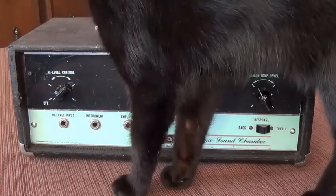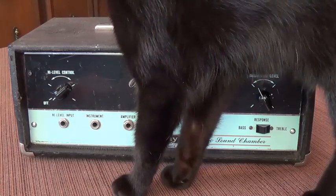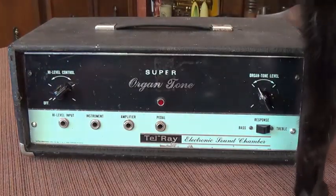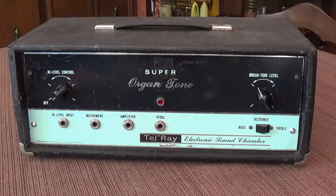The whole oil can concept was invented by a fellow named Ray Lubow, and it relies on a rotating disc of anodized aluminum that's coated with a suspension of carbon particles. Then neoprene heads will write on the disc by creating an electrostatic charge in those carbon particles. These written messages are then read by another set of neoprene heads and combined with the original signal to produce some really incredible effects. The key to all of this is a very special type of oil which is used to coat the disc and preserve the electrostatic charge that's stored in the carbon particles on the disc surface, to keep that charge from dissipating into the air.